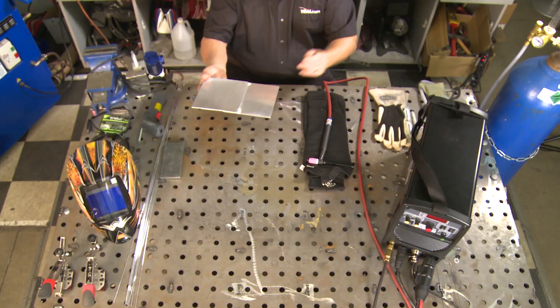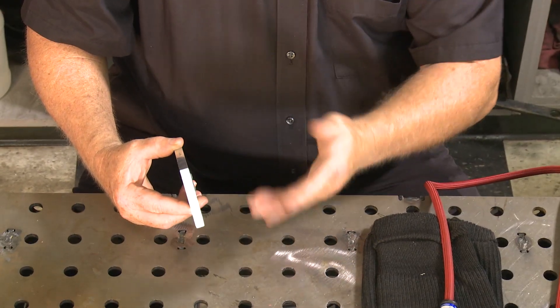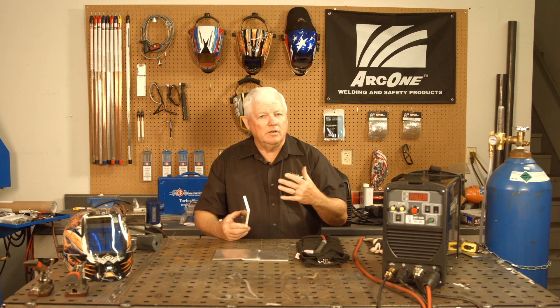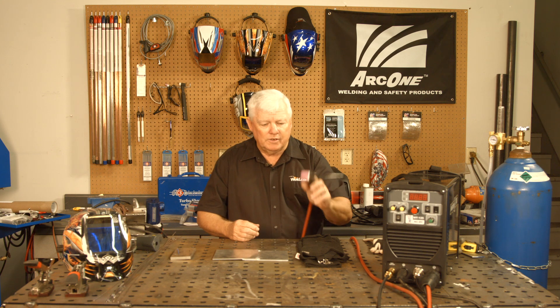Then what I'm going to do is cool this plate off and show you how you can take half-inch or three-eighths aluminum — pretty thick plate — use the same machine, except we're going to do a little preheat. I'm going to show you how little effort it takes to get you there. I'm just going to use 3/32 diameter tungsten, 2% thoriated, 15 to 20 CFH argon, and I've got some 4043 filler. It's a lap weld, so it's actually a little stronger than a one-eighth inch weld as far as the mass is concerned.